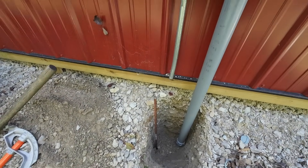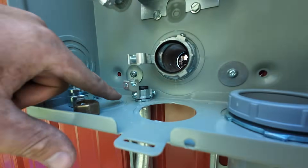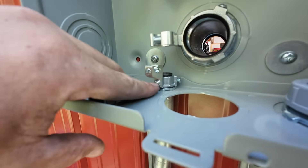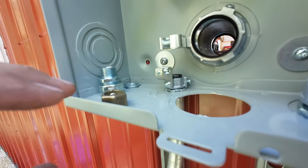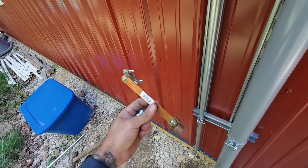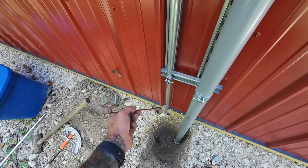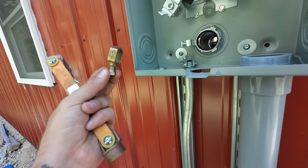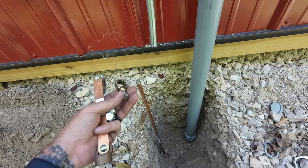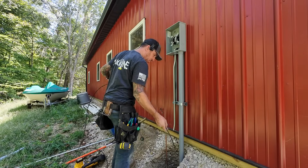On the back side here you can see this half-inch knockout — that is going to be for a half-inch piece of rigid that's basically just going to run down and stub out just at ground level and attach to our ground rod. We have our eight-foot ground rod pounded down, just slightly below the end of the half-inch rigid. Inside we've got a lock nut on the bottom, a lock ring on the top, and then a ground bushing — very important, ground bushing. Next thing we're going to need is a threadless rigid half-inch connector and a JPS-100 grounding strap that's going to ground our wire and that pipe to the ground rod. We also have a five-eighths acorn clamp — slide that down onto the dirt first.